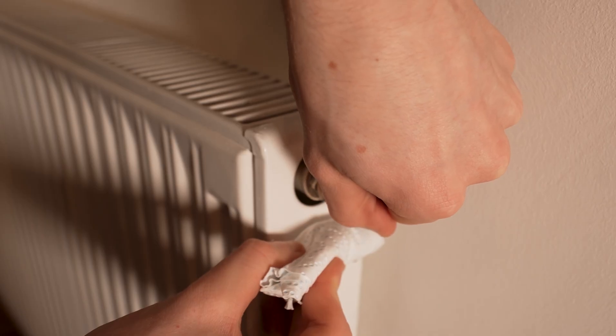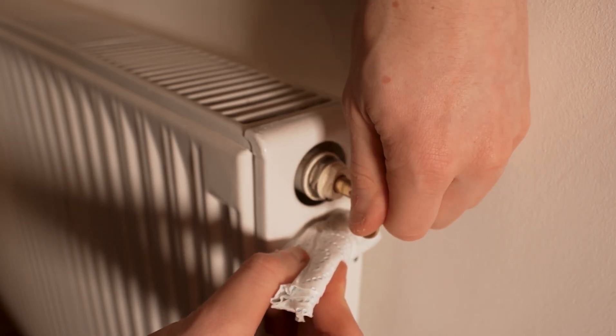Allow a few minutes for the system to drain and eventually the flow of water will come to a halt. This does not mean your system is empty — you have to go upstairs and bleed the radiators to allow more air into the radiators. As the air flows into the radiator it pushes the water from the upstairs layer of your house down into the lower floor, into your drain valve, down the hose and out into your garden. Be sure to bleed every radiator on the upstairs floors to make this work.